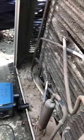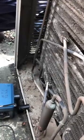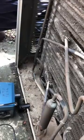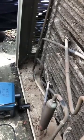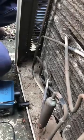I never thought about trying to meg a motor while it was on the vacuum. Well, somebody has done that — people do that. That's why they know. And there are even extreme cases. Haines will tell a story like this — there was a crankcase heater or something that someone was checking with a Megger, and it was hooked up to the compressor wiring, and when they checked it they destroyed the compressor. Never, never, never meg anything under a vacuum.